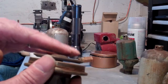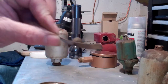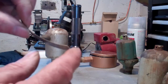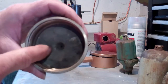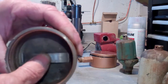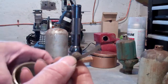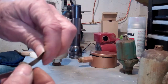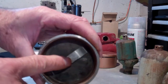When steam spreads onto the wafer, it causes the internal volatile liquid to flash into vapor, which makes the wafer pop up. Now, as it pops up, there's a piece that looks like a spring — a bent piece of metal with a ball on it. It flexes into a socket. You can see how it moves when I push on it. Because the spring is curved, with the ball seated in the socket, this vent naturally wants to stay open.